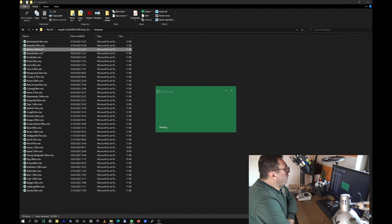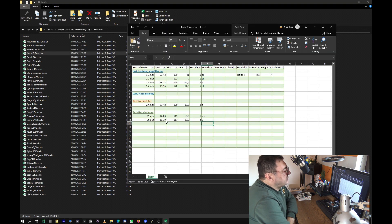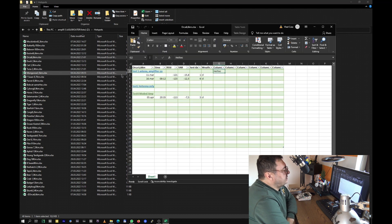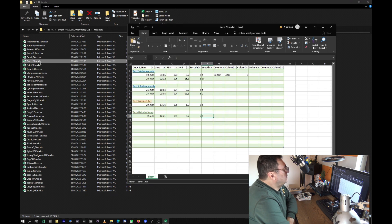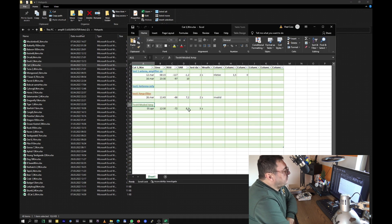I'm sure about that. Baboon — two beacons for this week, a disaster. Pretty good signals — I can't say, it's almost like the amplifier only with no filter. But like I said, I don't trust the network anymore. It's a test anyway — an experiment, let's call it. Here, the Kestrel — 6.6 kilometers away — the signals are pretty okay, far better than the other three weeks before. I'm not talking about numbers of beacons, just about RSSI and SNR figures — much better. Duck — obviously better, a really good improvement having the filter straight on the amplifier.